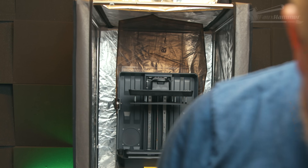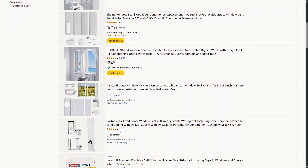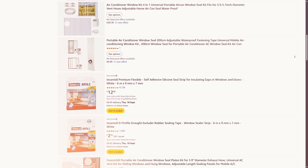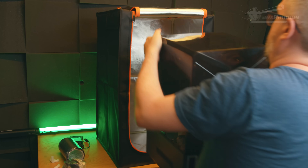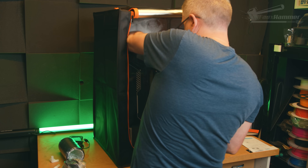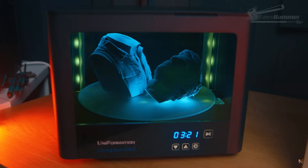If venting out of a window is your only option, you can use an aircon window seal kit — links in the description. Just be aware of home security and all that. Also, resin printers should never be used in direct sunlight, even through a window, because UV light cures resin. For those of you with limited space or who sensibly feel the need to be a bit safer in terms of fumes, I'd put one of these up there as a must-have accessory. Just be aware that post-curing resin also gives off VOCs.